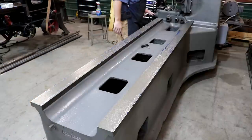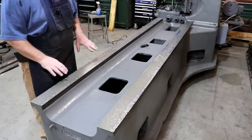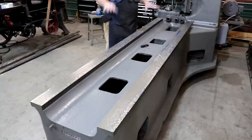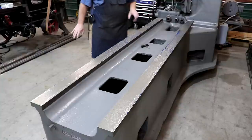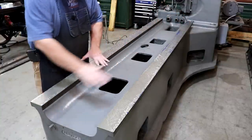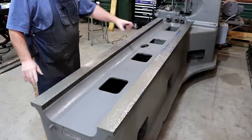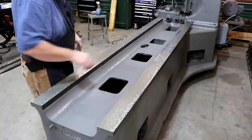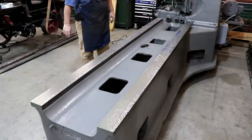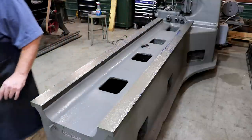Second print. I'm taking a quick look. Similar pattern to last time — I can kind of tell where my scrape marks were. But overall I'm seeing a lot more blue in here than on the last print, so that tells me we are dropping things down. Still got a couple of weak spots, primarily right in here, although we picked up a lot of print in this area. Generally speaking, the back end of the table is still a little bit on the low side. We are picking up contact, but it's just on the edges. Not going to do a whole lot of scraping up in here, but I need to get these areas down a little bit more. We are making progress.